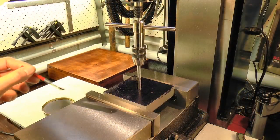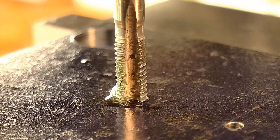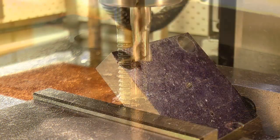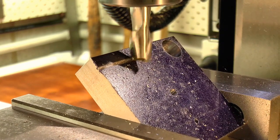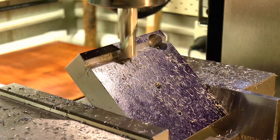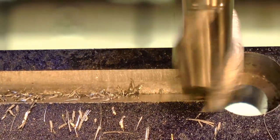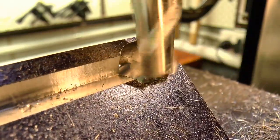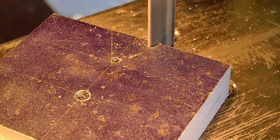The center stud location was then tapped, and then the v-groove for the cross hole jig was milled. Now I would have liked to have used a double angle cutter for this, but I don't have one. So I tilted the work to 45 degrees and then used a standard end mill. And it was a bit fiddly to get this right. The cutter needed to be fed down and across the same amount with each cut, to put the groove into the correct position. I won't know how successful I was with this until the very end when I do some test drilling.